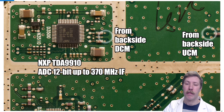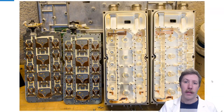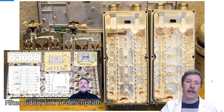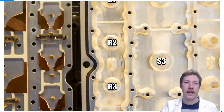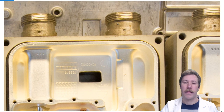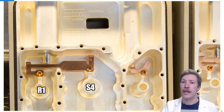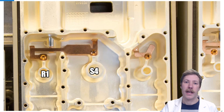The power amplifier now sends an amplified signal into the diplexer. The output filter — also called diplexer or bandpass filter — is very narrowly and precisely engineered for the 1800 megahertz carrier frequency. On the left side there are tuning pins along with automatic tuning via small geared servo motors. At the antenna connectors, two panels connect to one filter — one going as a receiving antenna and one as both transmitting and receiving.